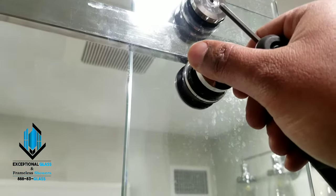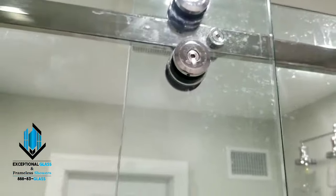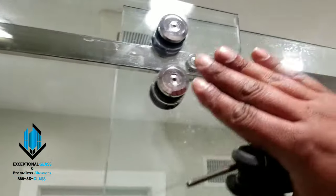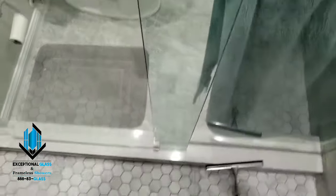As you see, by the time I turn it, you can see how the wheel goes up higher. That means the door will be lower in this place. This doesn't physically do anything aside from keeping the door from kicking off and falling off the top rail, so this is already secured.